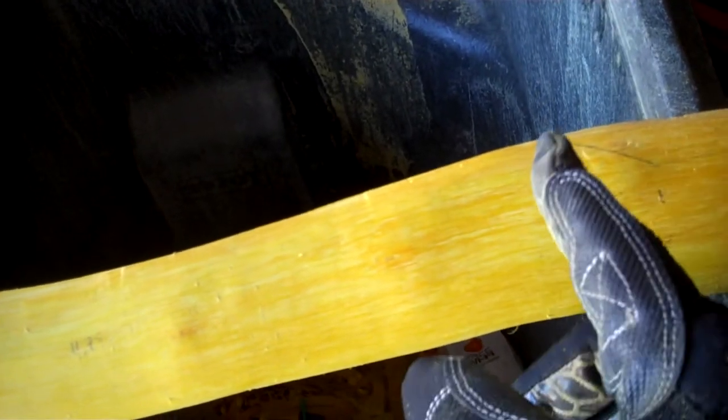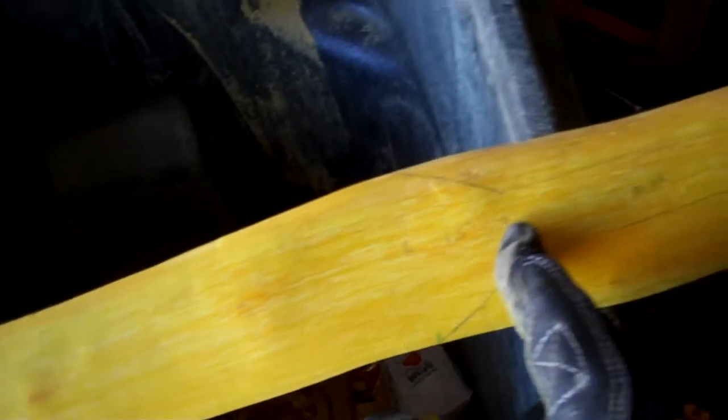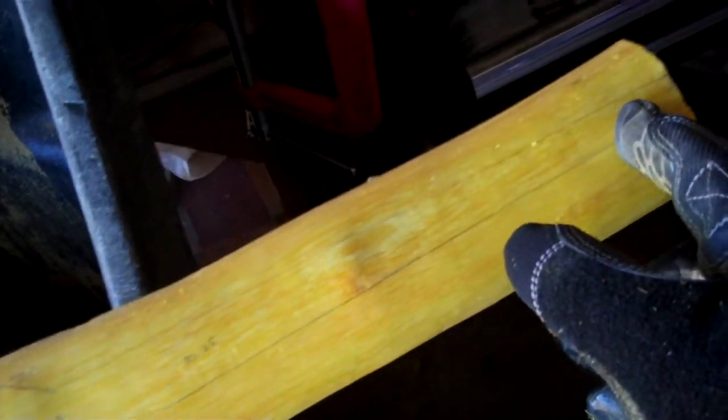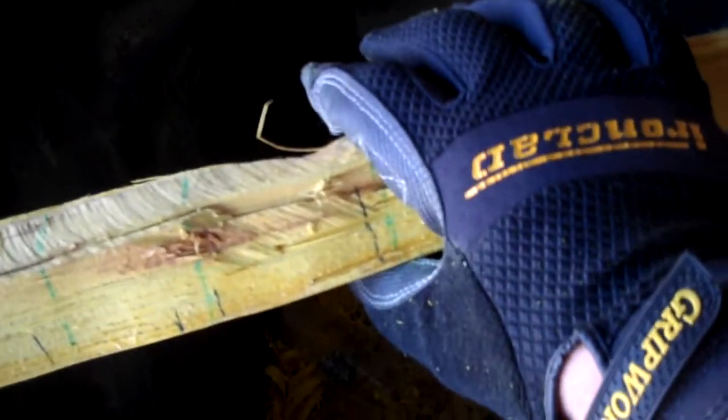and then from the halfway point, you're going to fade out. In this case, I faded out 1.5 inches, and then it faded to 1 inch, which is going to, again, taper into 3/8 of an inch at the tip. A little bit different than the Molly. And then, of course, repeat it on this side. Another thing, in the process of reducing this, I'm not going to reduce the area where the handle and fades are going to be. I'm going to leave that full size. So this area here, between here and here, I'm not going to reduce this wood. I'm going to leave that full size.